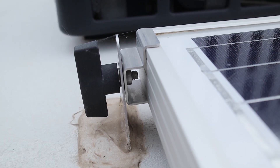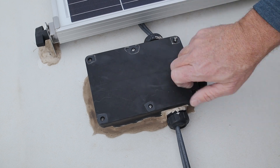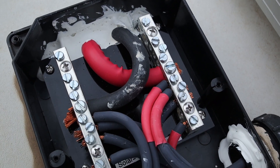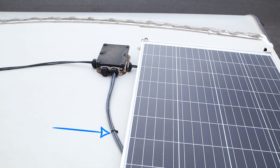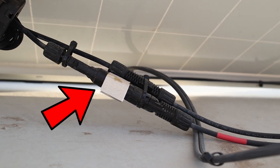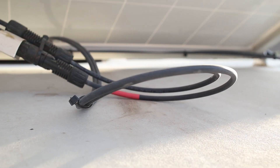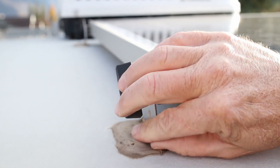About once a month, sometimes every two months, I'll get up on the roof and double check my connections. It's been over a year of operating and they've always been tight. I've got thumb screws that tighten the panels onto the brackets so they're not permanently installed. I purchased a roll of 10 gauge photovoltaic power cable and bought red shrink wrap to mark which end is positive and which is negative when I put on my connectors. I routed them across the roof — nothing screwed down or permanently mounted. I used an MC4 crimp connector tool to put on my own connectors, and then I used inline 20 amp fuses to protect the solar panels in case there was a short up on the roof.